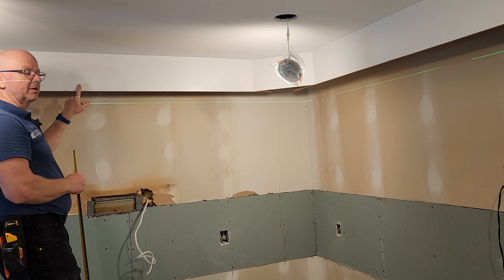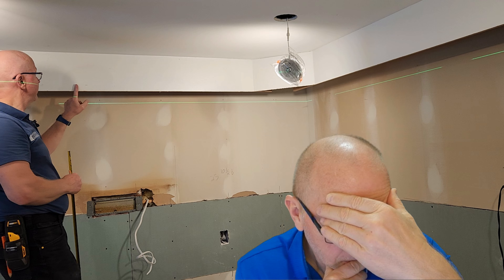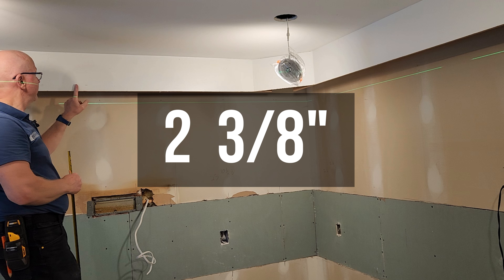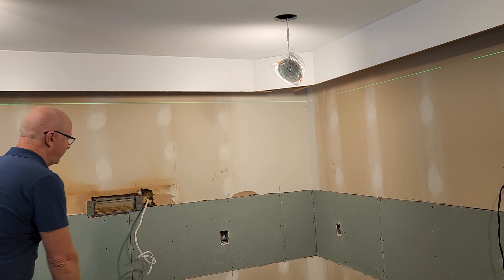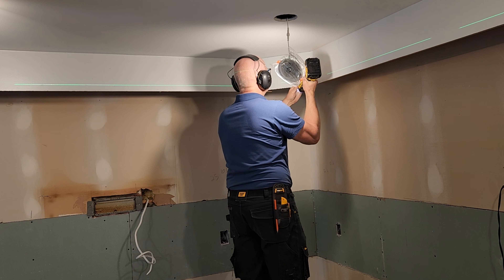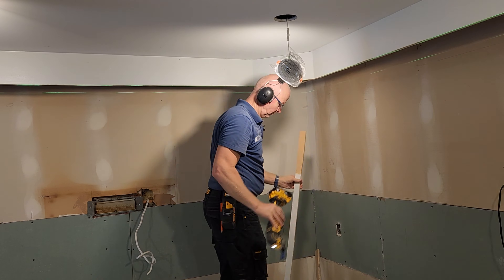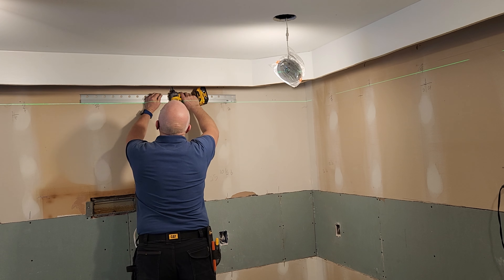That distance from the laser line to the cut mark — the right distance when you want a tight fit between the bulkhead and the upper cabinets is 2 inches and 3/8ths of an inch. That's where you want to cut. So now I can move my laser upwards, and with the laser in place on the mark, you're ready to cut the bulkhead. When the bulkhead has been cut away, you're ready to put up the rail and hang the cabinets.